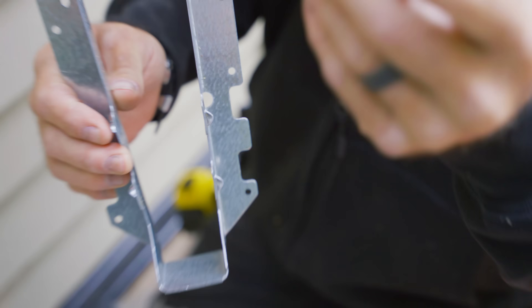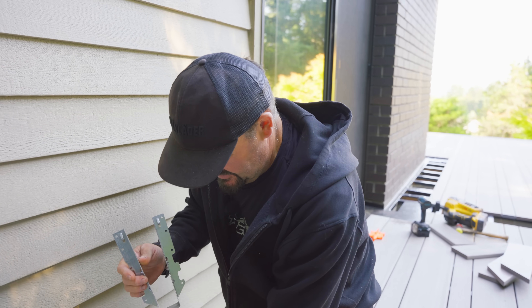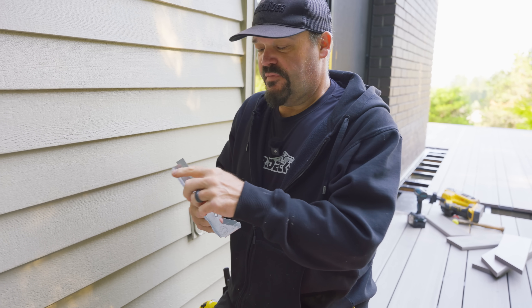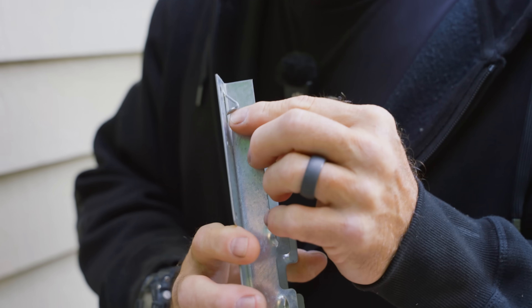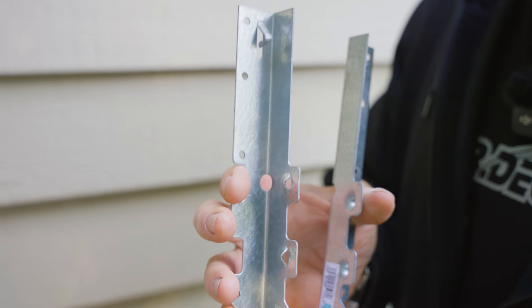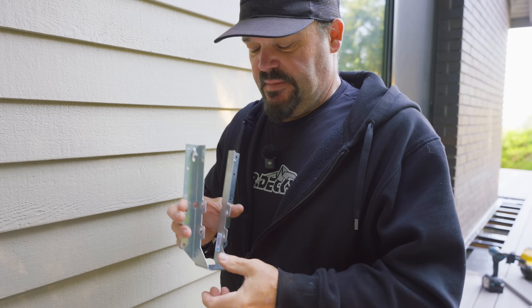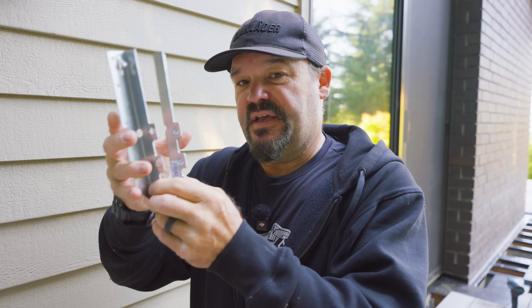We're going to take some of these for our side fasteners, and then we have the inch-and-a-half for our face fasteners into these four holes here. You'll also notice on this hanger there's a little cutaway that you can hammer in to hold the joist hanger in place. One thing you want to make sure when installing this is that the bottom of the hanger sits all the way up against the bottom of your joist — that helps hold it in case it wants to drop. Make sure it's up tight for a nice snug fit.